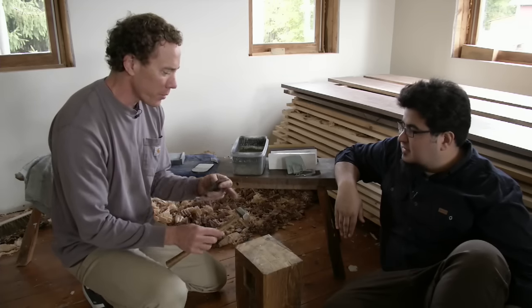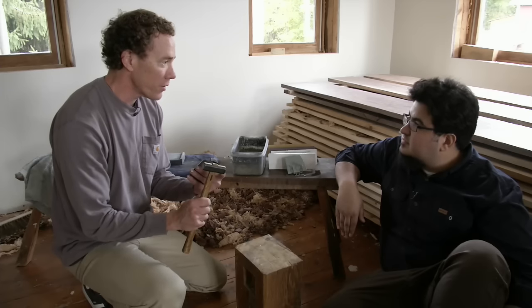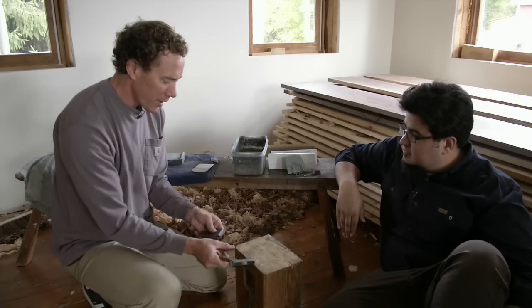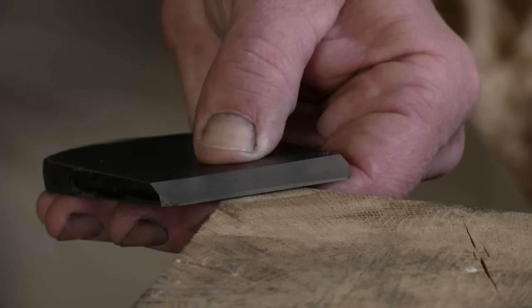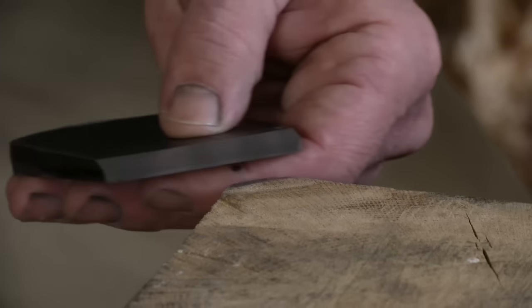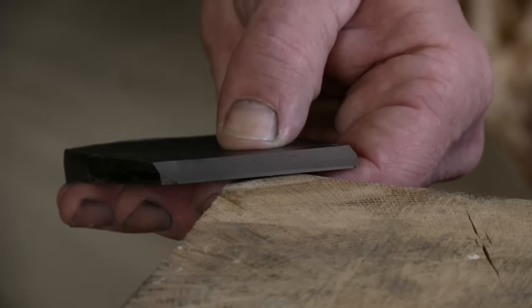There are specific hammers with a point, but with a regular hammer you can use an edge — same effect. I'm putting the blade on an end-grain block of oak; you can also use an anvil. The key is to support the hammer blow directly below the hit, which takes out vibrations. The hard steel is brittle — you don't want to vibrate it, it could crack.